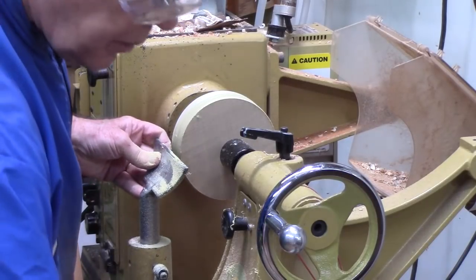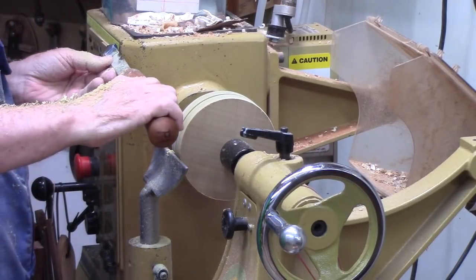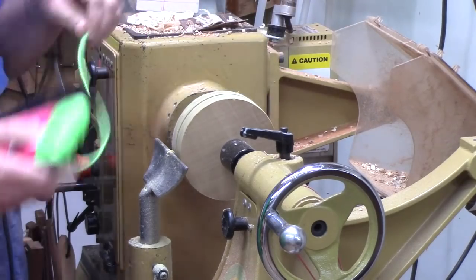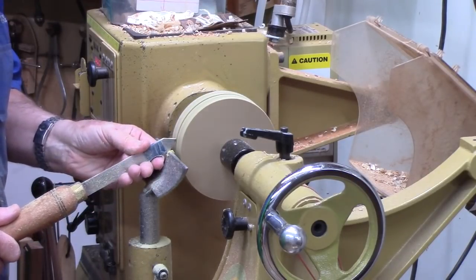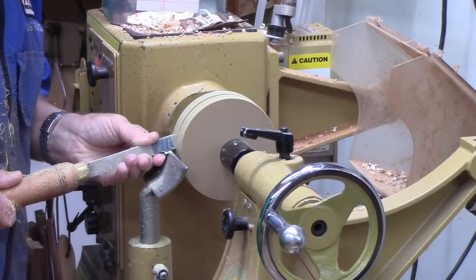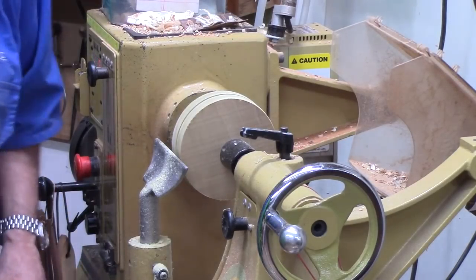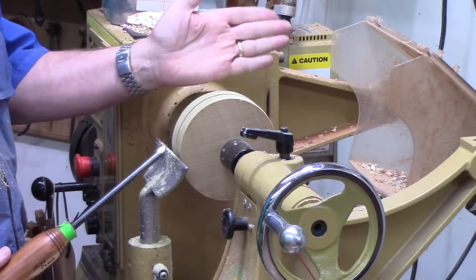Before we go any further, I'm going to get a pencil and mark the center of this — that's how deep I'm going, which is actually a little over 3/4 of an inch. Now let's get a feel for how snug this is. That's a little too snug; it's going to rub too much. So I'm going to take this tool and just take a hair's width off of one side. I can see a little bit of a tool mark, and that's got it. I'll use my detail gouge and pick up the cut, going down just a little way so if the cord is uneven it will flow back into that slot.